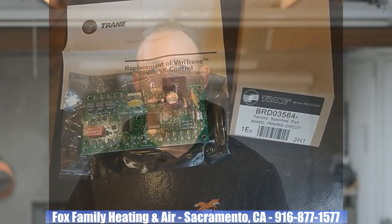But if we bring with us a body full of static and touch that control board, we can create a very minor defect in the board or make a pre-existing, undetected condition even worse. All of these just break down the control board over time until it completely fails.